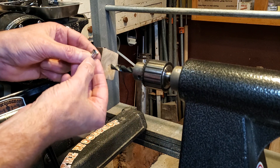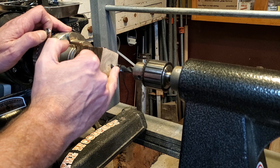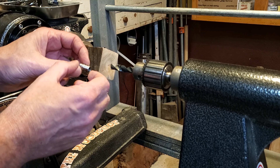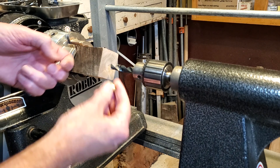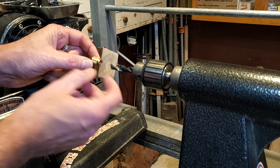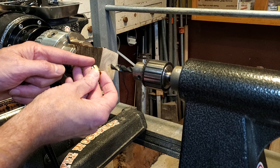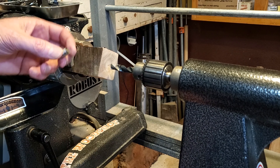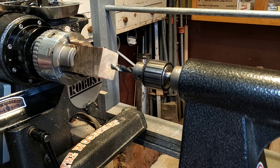I'm going to go ahead and install a stainless steel one. I have it marked here on my drill bit — the drill bit is 7/16 and I go down 7/8 of an inch. Give yourself a little bit of room for air compression, especially if you're using the brass one and going to make a pizza handle where the threads come way out — you need to drill down a little bit further.